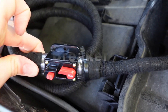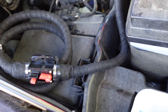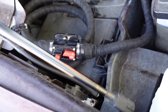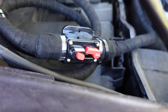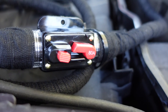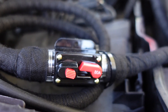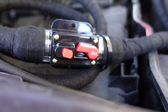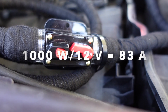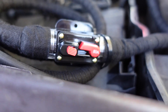This is an 80 amp fuse. You might think, well at startup currents and transients when that inverter starts pulling power you're going to pull more than 80 amps — shouldn't it trip? The thing about fuses is they have an associated time curve with them, and that curve steepens as you get higher and higher in current. So the 80 amps is actually pretty much the rated fuse for this load, which is 1000 watts at 12 volts.